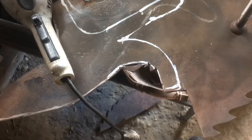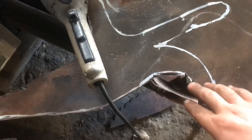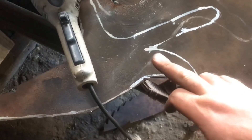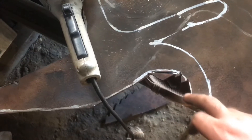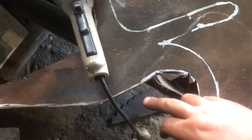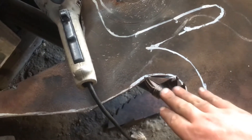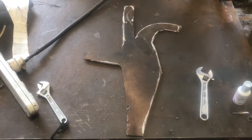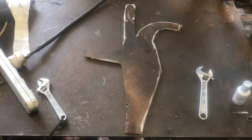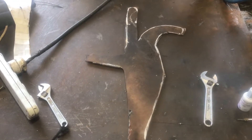Just a note on cutting around corners: it's okay to break it off into smaller segments. I'm just changing my blade over — we'll cut it off there and then cut it off there. Don't try to go around tight corners; this radius here was a bit small for the size of disc I'm using. I have it roughly cut out now, so I'm going to hit it on the linisher and just smooth all the edges before we start putting the tapers in.